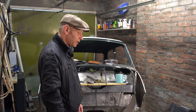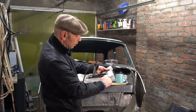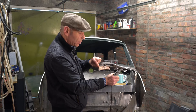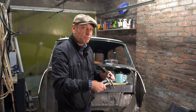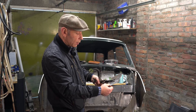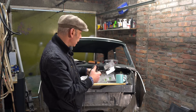So I'm going to show you how to dial in a MIG welder to weld sheet steel. I've got a piece just mocked up — I took my flap wheel to it and cleaned the metal up. That's a wee copper backing; I got that off Frost years ago. I've got a computer heat sink as well — they work brilliant. Put that at the back of the sheet steel and it stops warping. I'm just making a mock-up of roughly the thickness of steel I'm going to be welding.